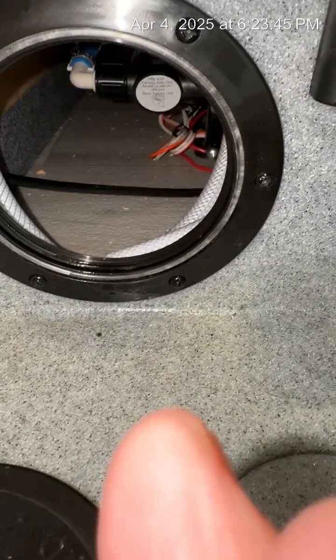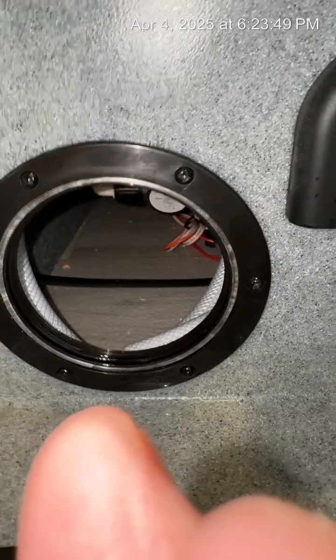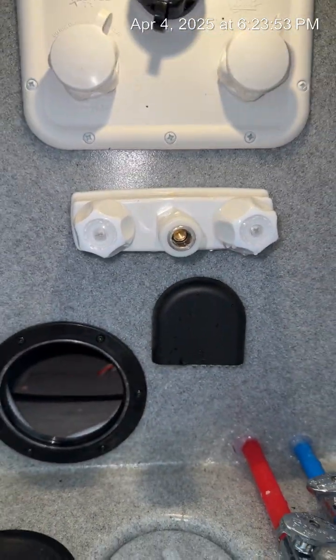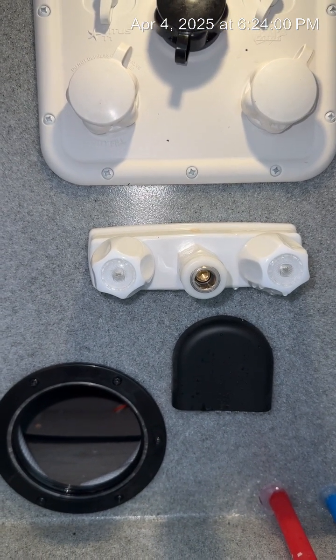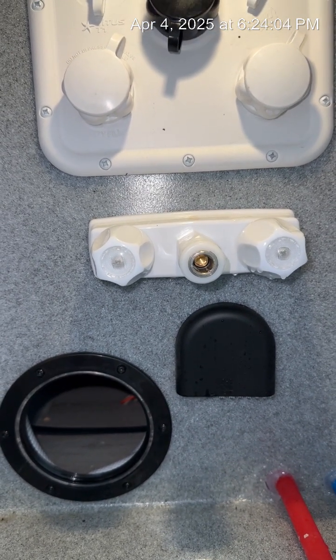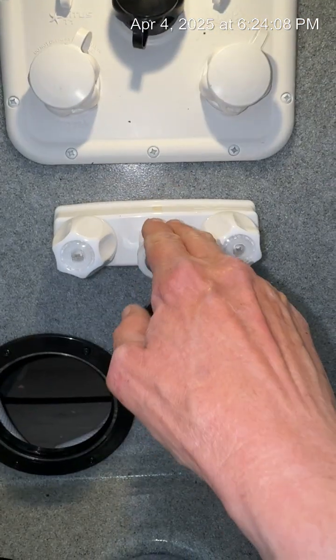And then that white hose that's here, you drop that down into your antifreeze and go inside and turn your pump on. Start turning on your faucets, and whenever they run the color of your antifreeze, you've winterized it. They always say to start at the furthest point from the pump. And in this case, I believe it would be your kitchen sink. So start there and work your way forward. Don't forget to do this, all right?